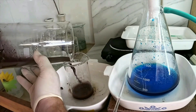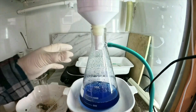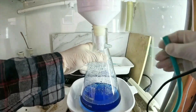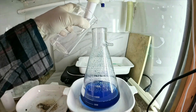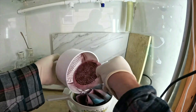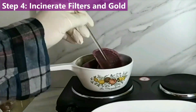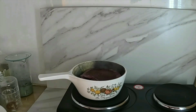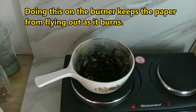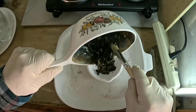We'll go ahead and get this transferred into the filter as well. Once filtered, we're going to rinse it with distilled water through the filter a couple of times in preparation for incineration. The filter is complete — there's our gold. Removing the filters, you can see why we needed that second filter and how much actually just came through. Placing the filters and gold on the hot plate will dry and ash the filter papers before we move on to incineration itself. Once dried, I will complete the incineration in the melt dish, heating the material to red hot — this will oxidize more base metals that I can then filter out later.